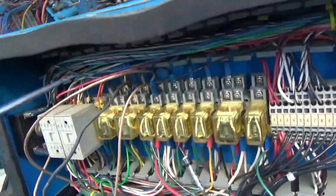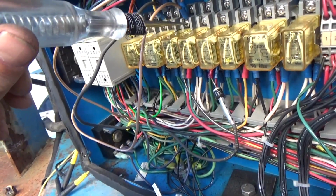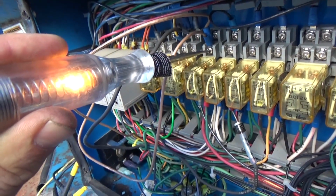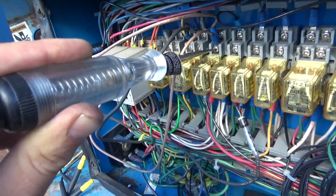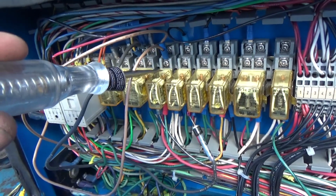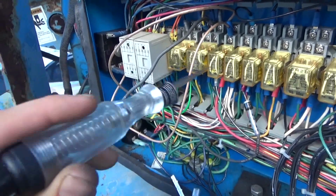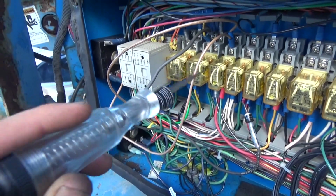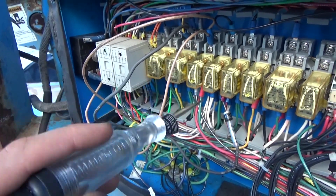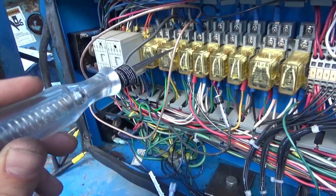Well, it's kind of a closed loop. Let's see if we're losing the feed up here when that happens. Boom. And the contacts never moved, right? Well, if we lose the power feed, then the contacts will switch, but when we bypassed from 1 to 9, it stayed running. So now the question is, is it a control side issue for CR3? And what controls CR3?